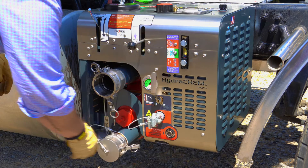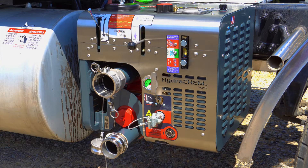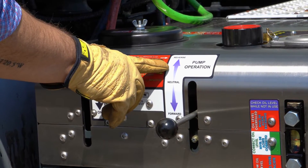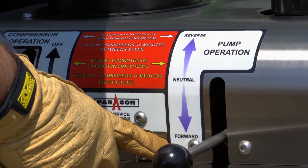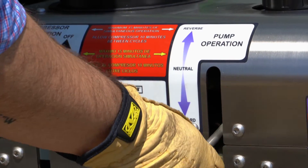Operation of the pump is simple. Disconnect the inlet and outlet caps and connect your product hoses. The HC-180 comes standard with a speed-controlled forward and reverse directional control valve. For thick materials, slow the pump down to allow for improved suction conditions. For lighter materials, you can transload up to 165 gallons per minute.